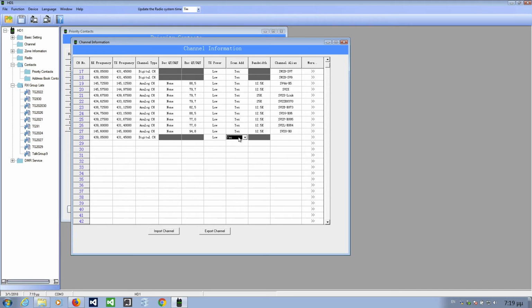Scan add. This means that when you scan with the radio, this memory should be included in the scan. If you don't want it, you just select no here. I always want all my channels to be included in the scan. Bandwidth not relevant. We're in digital, and let's name this. This is the repeater Sierra Whiskey 2 Delta, and TG9 is the group, the talk group I will use. Okay, these are the basic settings.